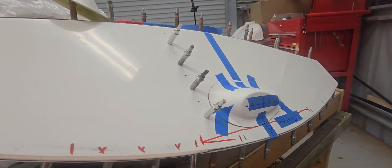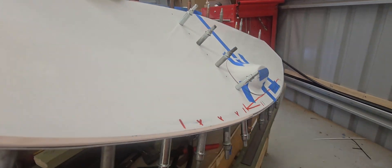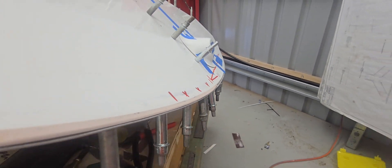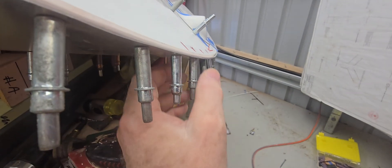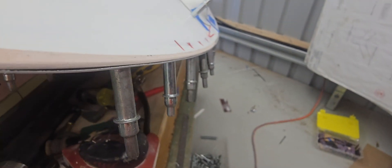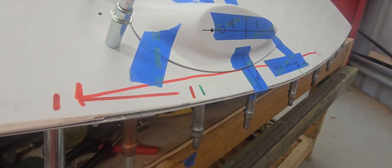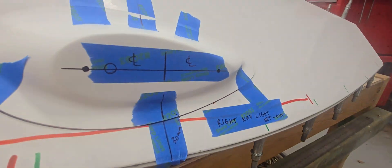Bear with me if I sound croaky — I've just been in and out of the air conditioning and on high humidity days you end up with the flu. I've had to build this section out because it was going in too much for my liking, and I think it's for the better. Looking down there now it's fairly without too many humps and bumps. I've body-filled that plus some fibreglass resin and I'll resin over the whole lot again and give it a good sand and prime.